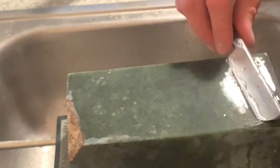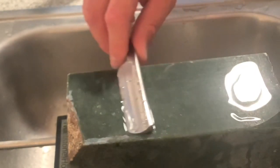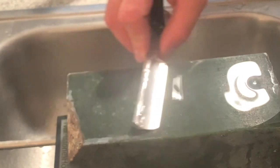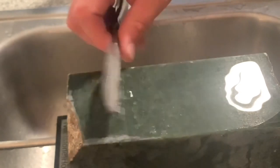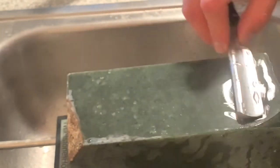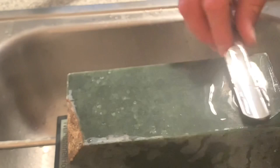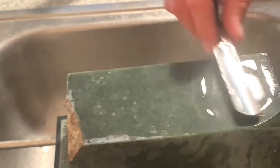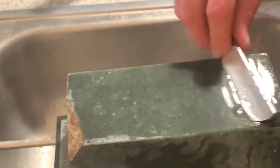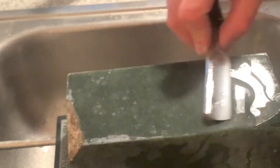A final honing stone really only needs to remove just a little bit of metal. The cool thing about really dense stones like jade is that if the surface is sanded rough, it'll actually sharpen rough. So if I needed to do a lot more metal removal, I could use a surface prep like 80 grit or 120 grit. But today I'm using this semi-fine preparation that's been loaded with steel, so it actually acts ultra-fine — like 30,000 grit or beyond, approximately.